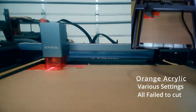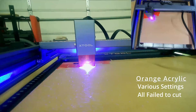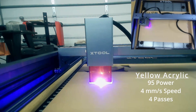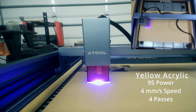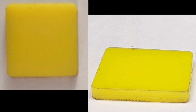With orange, you can see that I had a few failed attempts. I tried different things, including taking off the masking, but what I ended up with was that after a few passes it actually bleached out the pigment color and turned it white. So I might find a use for that with engraving, but it didn't cut. I also noticed that the bottom of the cut pieces had a little lip sometimes, where it looked like it had melted and then flowed a little — you can see that here on the edge. So in future I'd probably unmask both sides.